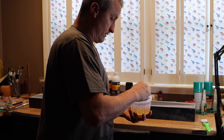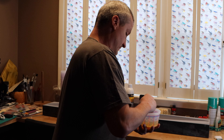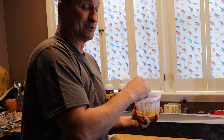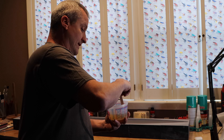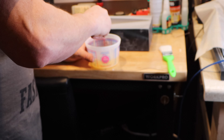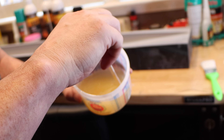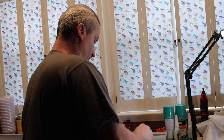This is the most important part — really mixing it in. They say you have to mix it for at least a minute. You can see it's all kind of honey-colored now. The hardener is a darker color and it gives the mix that tint, because the resin is totally clear. The hardener kind of sits on top of the resin and doesn't want to mix in, so you really have to work at it.